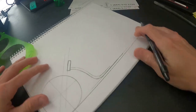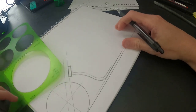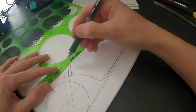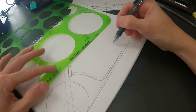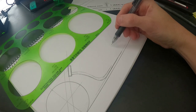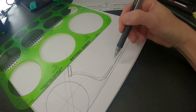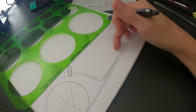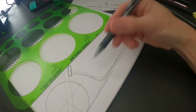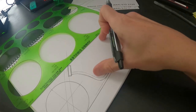Now we're getting into the other section — this is where our seat's going to go. On a frame you need to know where your head tube is going to be relative to where your seat's going to be. I run normally 34 inches, anywhere from 32 to 34, from head tube to seat. Pedal to center post of the seat is probably more important, because if your seat's real low you've got to come out more this way.